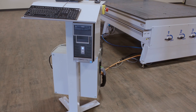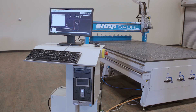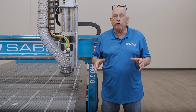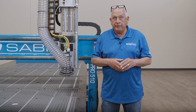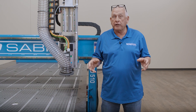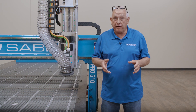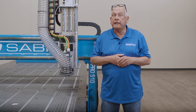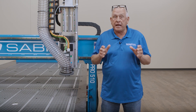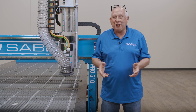The ShopSaber machine controller is the final part of machine motion. We designed the ShopSaber machine control on a powerful Mitsubishi platform. The operational part of the machine control includes a control stand with auto-leveling feed, an AtMachine solid-state hard drive for easy file management, and AtMachine CAD-CAM capability for changing files on the fly, plus our ShopSaber point-and-click technology.